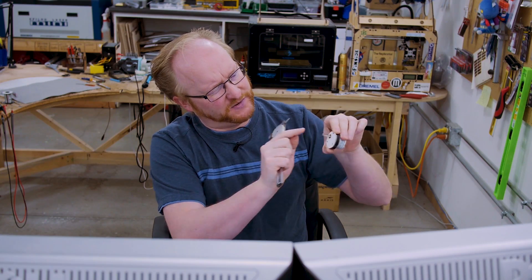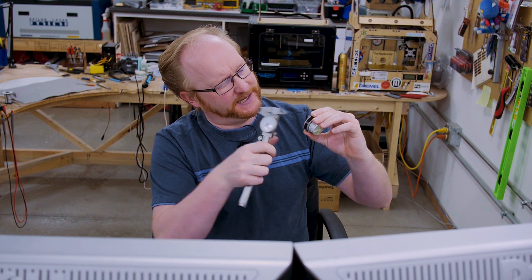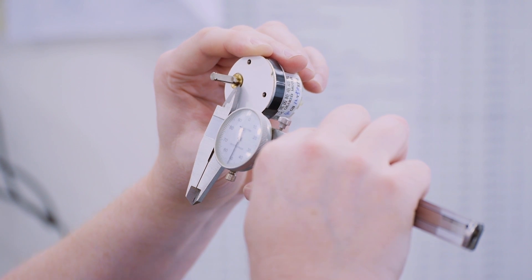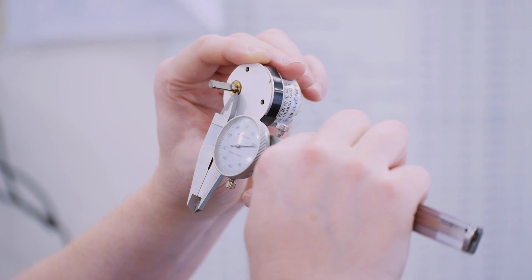These two are at 120 degrees, but this one's more like 122 degrees. I could probably also bring this shaft in just a little bit - like 0.2 millimeters. I've done all these paper patterns, but now I know when I print the test it will be correct. I use cheap, fast paper instead of slow, expensive plastic.